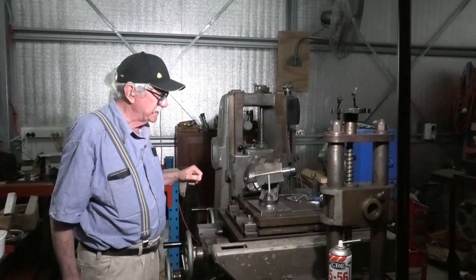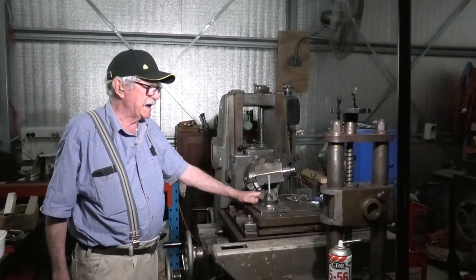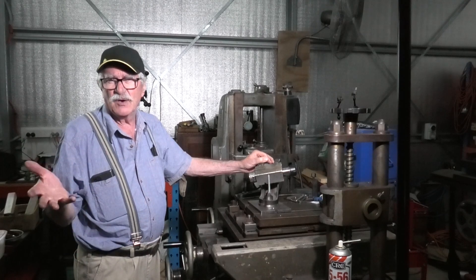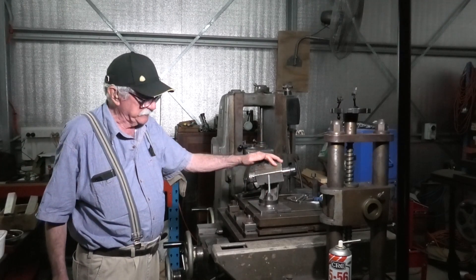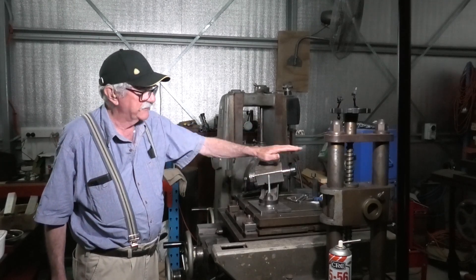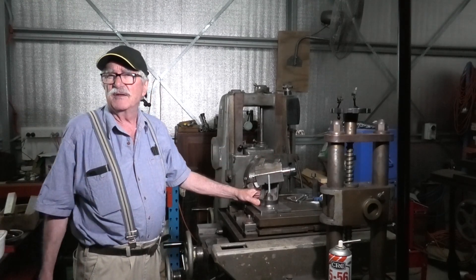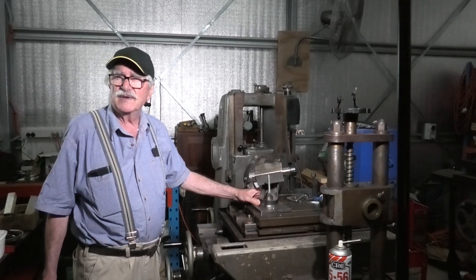In the dim past I've done something where I couldn't. As I built it, I started to realize that the pivot up here was fully cantilevered off the back of the frame — there'll be more in the demonstration later. I've had to put a gusset up inside the guts, and that meant it couldn't pivot down far enough to get enough sweep at the front, so I've had to do some modifications to the body itself. All in all, for something that's an unusual build and something I've never designed, I think I'm coming along reasonably well.